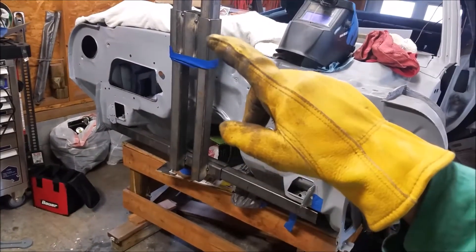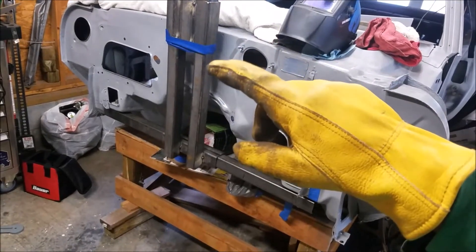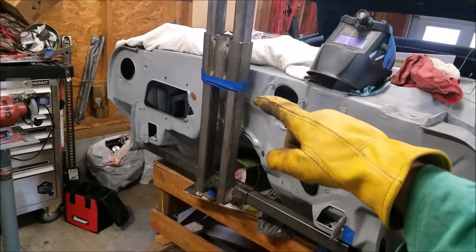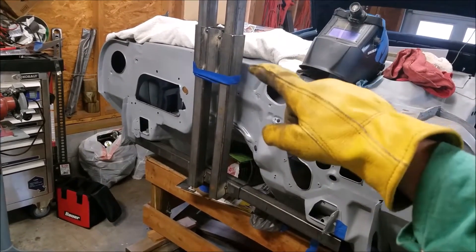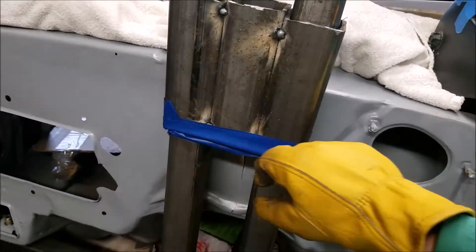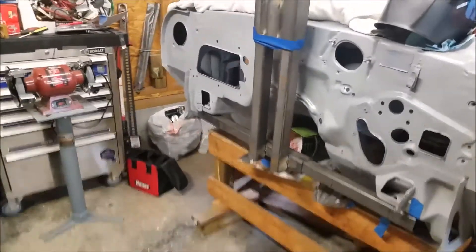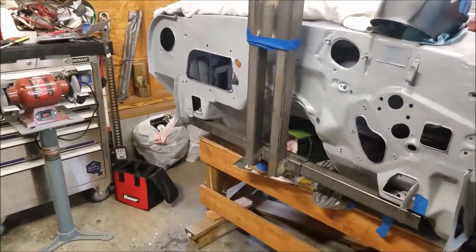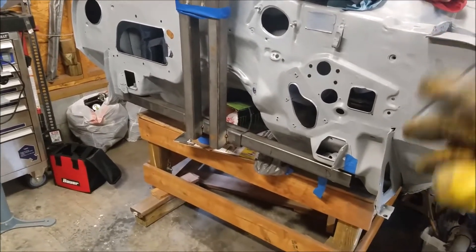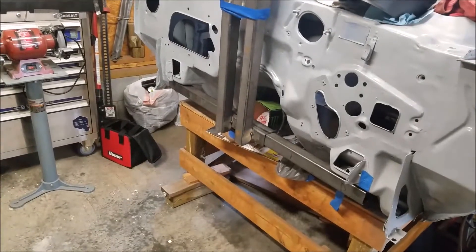This section right here will be able to move up and down like an elevator. When I find the right spot to rotate the car, I'll go ahead and tighten down the bolts — I'm going to have a hole right here and right here. I tighten them down and it'll hold the car. I'm basing this off of Rerat's front rotisserie mount; this is pretty close to what he has and I think it's going to work.